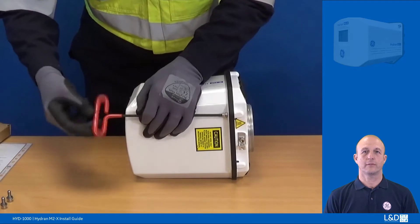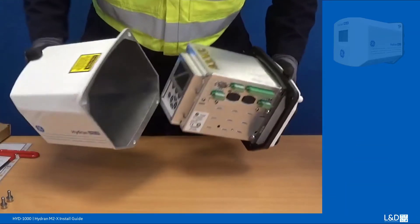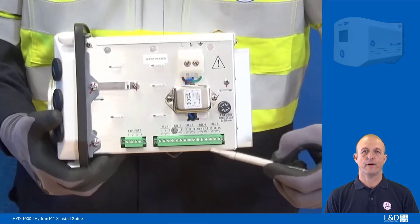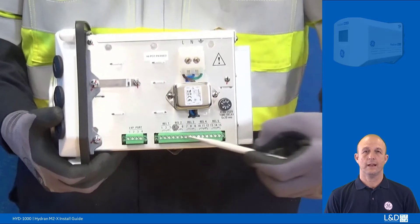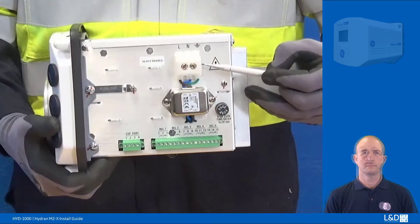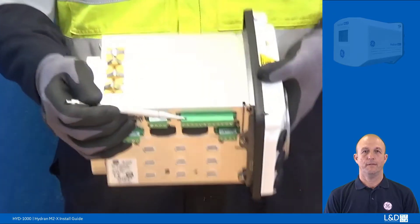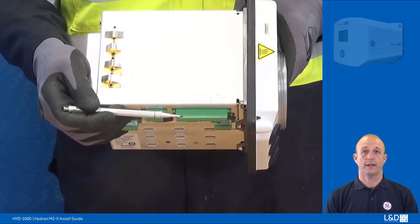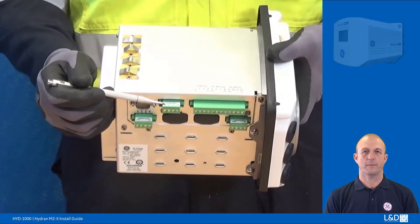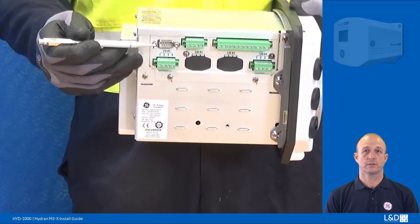Use the tool provided to remove the Hydran cover, retaining the screws for future use. Now we will identify some of the hardware features inside the cover. Here we have the expansion port — this is not currently utilised. Next to this there are five relays: relay 1 to 4 are customer configurable, and relay 5 is designated for the system service alarm. Above this is the inlet power fuse and the main input wiring connection. On the other side there are four input and output slots available for customer configuration. Above these is the TDM and RS-485 connections for single or connecting multiple devices together. Here is an additional communication port for alternative carriers such as ethernet or fiber optic. To the left of this is the RS-232 port for local connection and system setup with the operating software Multi-Host or via Perception software.